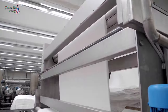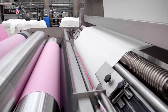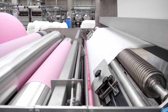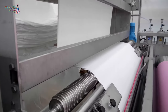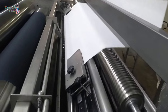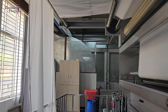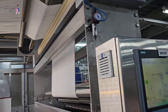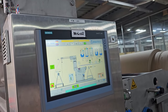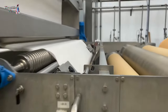Padding. The textile material is then passed through the prepared dye bath in a continuous manner using a padding machine. This machine ensures that the fabric gets saturated with the dye solution evenly and uniformly. The padder effectively forces the dye stuff into the fabric. In this stage, excess dye solution is also removed.